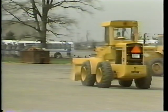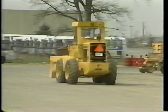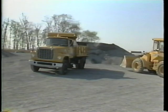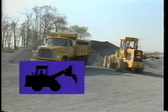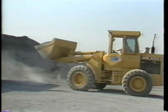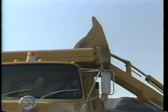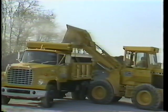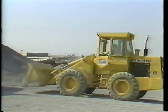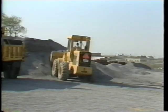All of these pre-start and warm-up checks are critical to safe and efficient equipment operations. Don't leave the parking area until the list has been completed and all checks have proven satisfactory. The third operator maintenance activity, the daily operation check, is carried out while the loader is working. During these operations, you should monitor your equipment's performance. Listen for unusual noises, check your gauges, and be aware of changes in the performance of your equipment. Listen for unusual engine and equipment noises — these warn us of problems that could damage the front-end loader. If any gauge reads in the danger zone, shut down the loader and check the system. Be aware of any changes in your equipment's performance and report them to your supervisor.